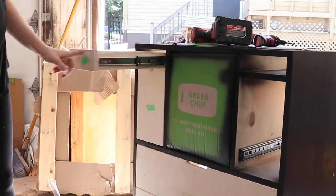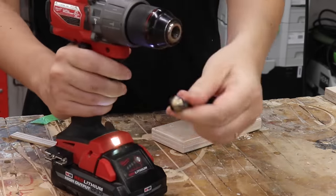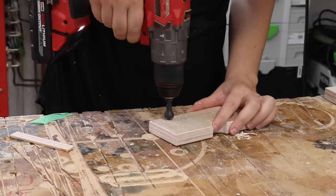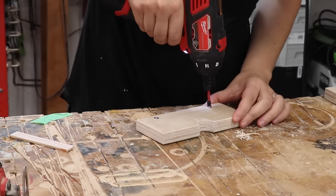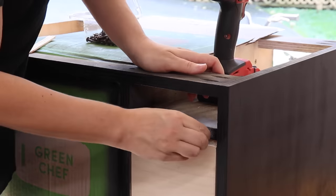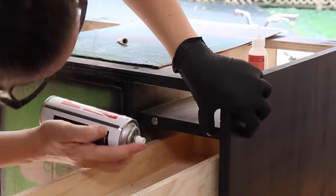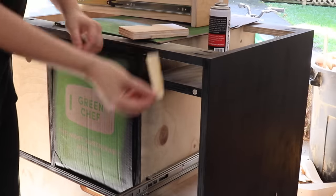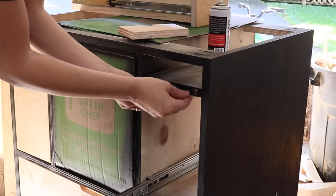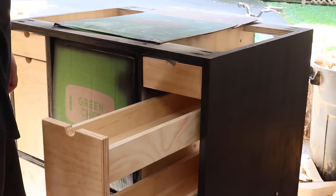The upper right section is going to hide all the cords and wires so it just gets a false front held in place with magnets. I drilled and countersunk some holes on the plywood pieces, drove some screws in, then drilled corresponding holes in the edge of the cabinet plywood deep enough for magnets to fit in and installed the magnets with CA glue. The magnet was holding it to the cabinet but not in the correct position, so I used some more CA glue and scrap to make a little lip that the false front can rest on and keep even spacing. Much better.